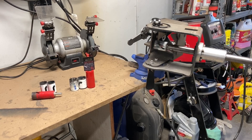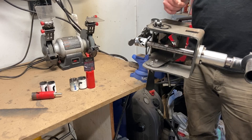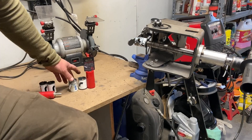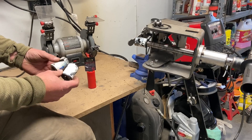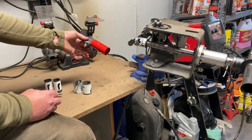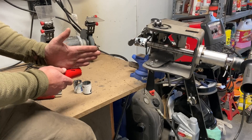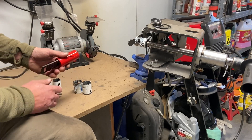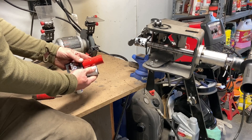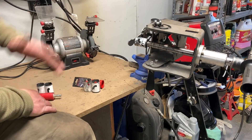With your notcher you're going to need a power drill. I'm using a Harbor Freight plug-in 110-outlet power drill — don't try to use a cordless one, you need that grunt to get through metal. I have an assortment of hole saws; you can go to Lowe's or Home Depot and get one-and-a-half inch and one-and-a-quarter inch hole saws. Rogue Fab has their deep well hole saws, which let you get a steeper cut on your tubing without stopping to cut the end off with your angle grinder. Get more than one hole saw because they wear out.